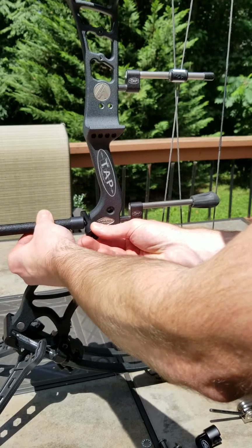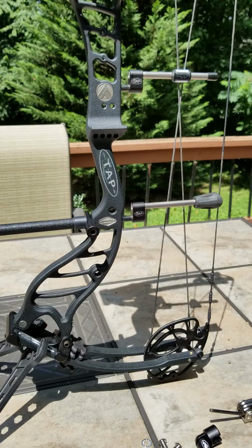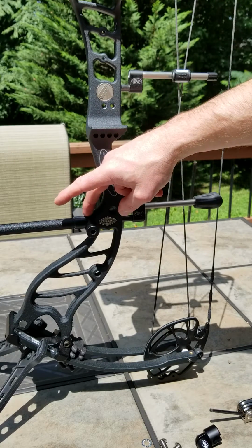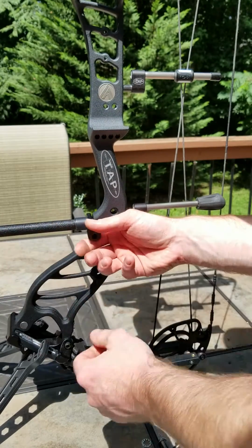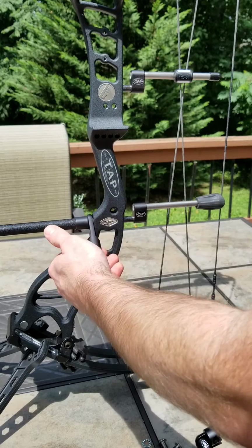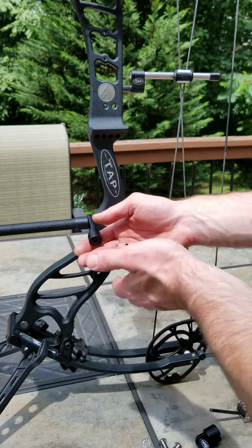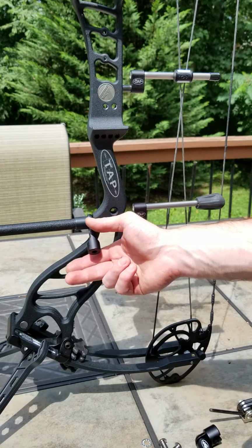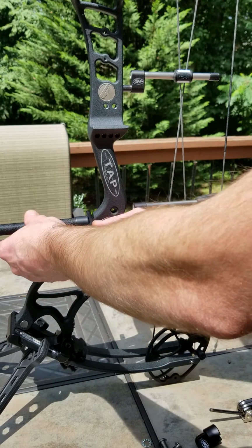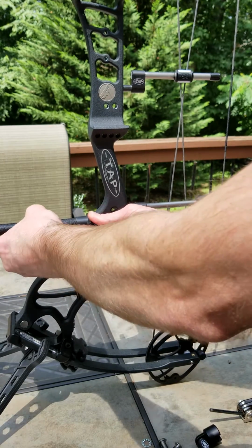You can hand tighten the stabilizer down to the required amount of force that you need to get this to the position that you want, secure enough. We recommend that you use about half of the available space in most cases. If you don't need to use more of that available horizontal adjustment, don't, because the further out you place this, the more flex you could get, depending on how much weight you're running on the side stabilizer. Most people don't run enough weight to incur a large amount of flex in the bracket, but some could. So for most purposes, it's sufficient to have it mounted about halfway through.